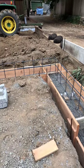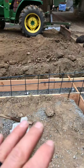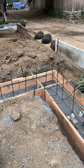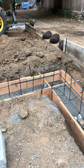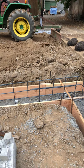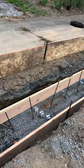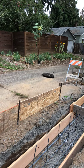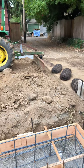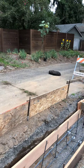One thing I didn't know before: you start digging at all, you're supposed to call the City of Portland for an erosion control permit or inspection. I have not done that yet. I talked to the city today and I'll just call that in tomorrow when I call for the footing inspection. I've placed preventatively some absorbent things out here and dug a little trough to keep the mud from going into the storm drain, which is their biggest concern.